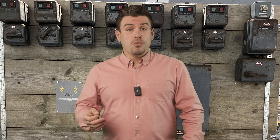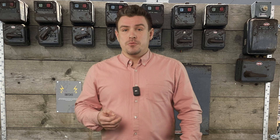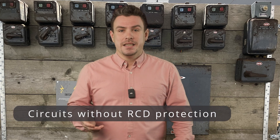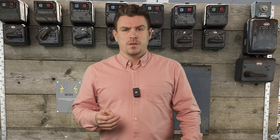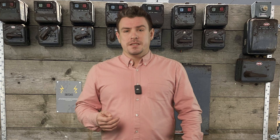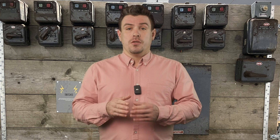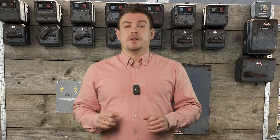You may know that all outdoor equipment needs to be protected by an RCD, whether it be in the consumer unit or directly before the appliance. But up until the 80s there was no requirement in the wiring regulations to have RCDs. I've talked before about how I feel that RCDs are one of the best improvements in the modern world of electrics. Nowadays it's mandated to have them installed on all circuits below 32 amps — although on commercial there might be a way around them involving a risk assessment.